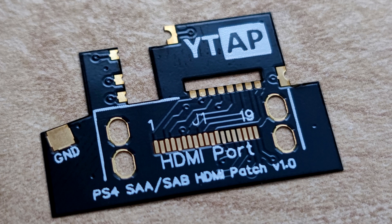So on to what we're here for today, and why I think a lot of the new subscribers will be here. That is indeed for the thing that you see on screen in front of you right now. This is what I call the HDMI patch, initially available for the PS4 original models with the SAA and SAB001 motherboards. It's compatible with all those variety of motherboards and can be quickly and easily installed in scenarios where you have missing pins from the HDMI header — if those pads that you solder the legs of the HDMI port to are ripped out.